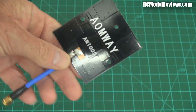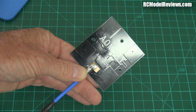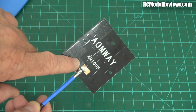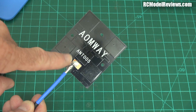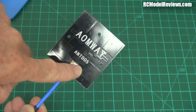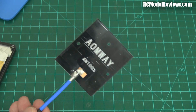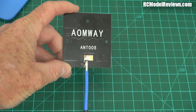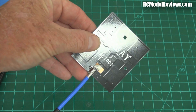That's the theory, but looking at the matching networks and the micro strips, I don't think this has been well designed at all. For example, these two patches have basically the same length of copper going to the center feed — something strange going on there. We do have a kind of phasing network, but it only has one input and one output, so it's not really causing any phase changes either. I think the reason this didn't work is it's just not very well designed. Antennas are tricky — this is black magic, this is voodoo, especially trying to make a circularly polarized patch antenna with micro strip.